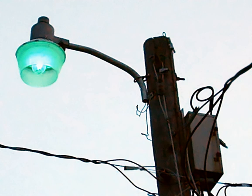Mercury vapor lamps are more energy efficient than incandescent and most fluorescent lights, with luminous efficacies of 35 to 65 lumens per watt. Their other advantages are a long bulb lifetime in the range of 24,000 hours and a high intensity, clear white light output. For these reasons, they are used for large area overhead lighting, such as in factories, warehouses, and sports arenas, as well as for streetlights.